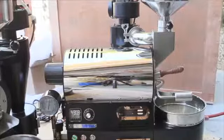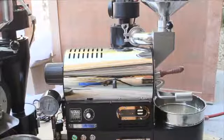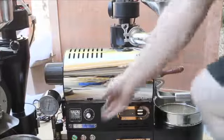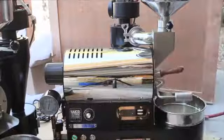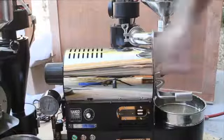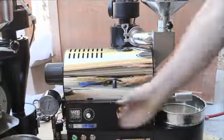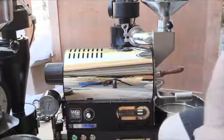As I've stated in other videos on these little roasters, we give them a heat test. On the big roasters we go up to 500°F to make sure there's no rubbing of the drums or anything like that. On these little roasters we just go up to 450°F, which is where I have it maxed out. It'll shut the gas off at 450°F.